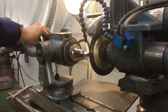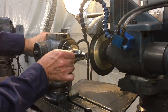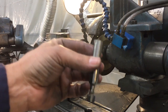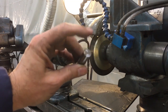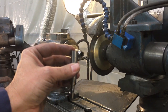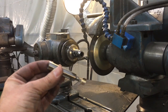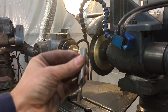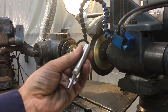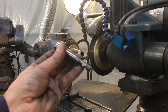I come back out and turn off the spindle and pull out the tool. There you go — a tool that's now half an inch shorter. I'd also hand-grind a small chamfer on the cut end with another diamond wheel so you don't damage your holder. This is an H6 shank, so it's about three tenths under nominal, real straight and round. In a good set-screw end mill holder it'll be a tight fit even though it's undersized. That's how to cut it off — if you have any comments or want to see more, let me know. Thanks, bye for now.